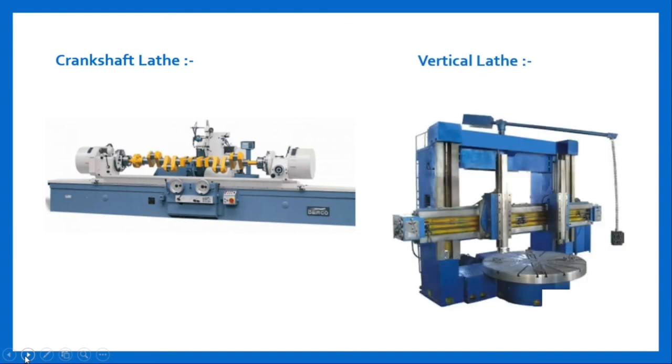The vertical lathe machine. Here is a figure of vertical lathe machine. These machines are employed for jobs like heavy and dense flywheel, large gear blanks, etc. The vertical lathe machine is similar to a horizontal lathe machine in which the machine stands up on its end. Some industries use this machine instead of horizontal lathe machine because sometimes facing comes up as a priority, while others prefer it for doing turning and boring on large and heavy rotating parts which cannot be done on other lathes. It has a heavy and dense base at the lowermost part which carries a face plate to grab the work piece.